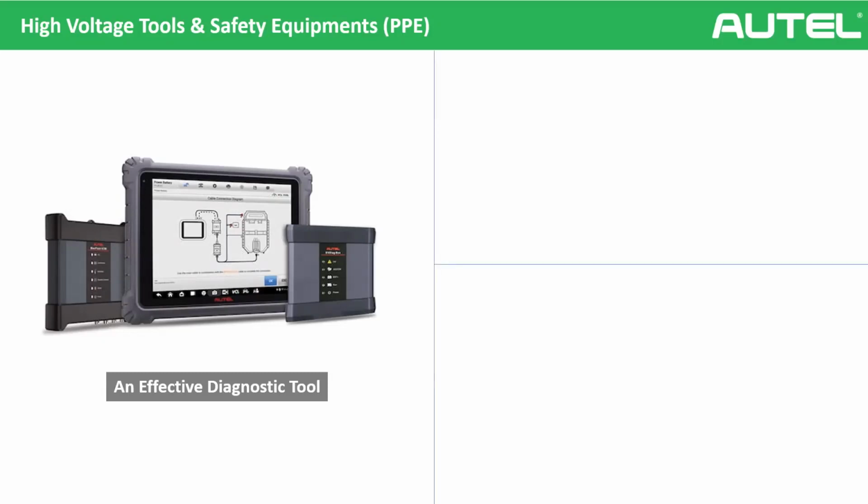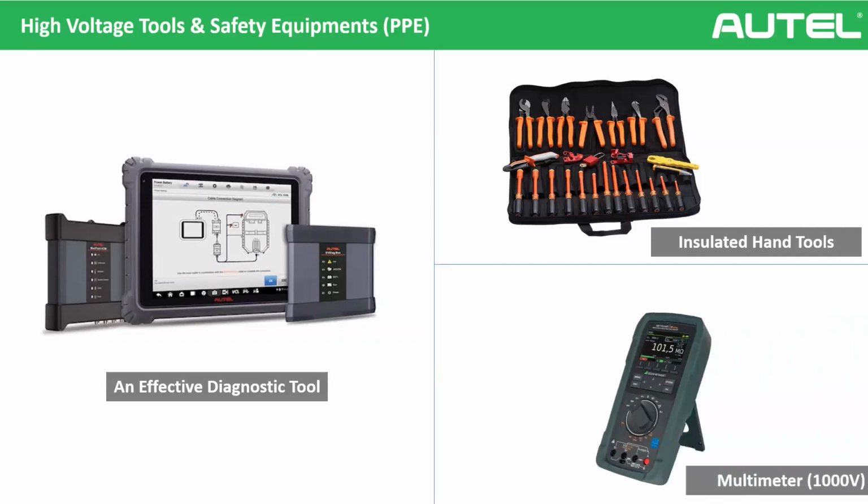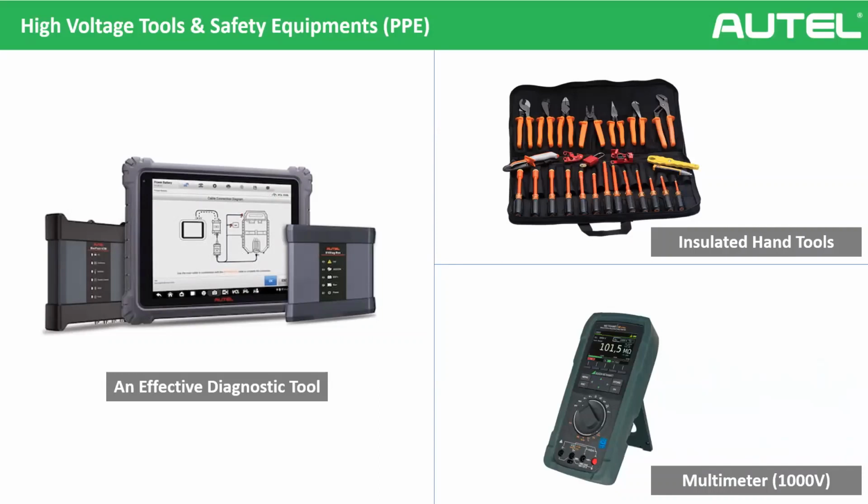And the second is insulated hand tools. It's very important because we are dealing with high voltage vehicles. Not normal hand tools. They should be insulated, at least 1000 volts. No matter what, we will use these. And last but not least, you will also need a multimeter rated for at least 1000 volts. It will be your left-hand man, while the diagnostic tool will be your right-hand man.